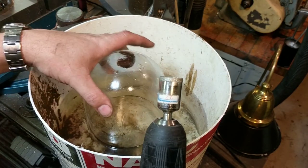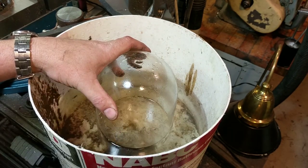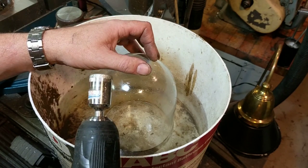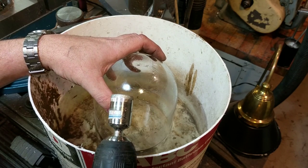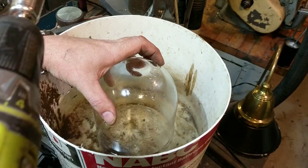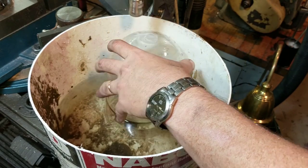I'm going to try drilling through here using this diamond-tipped core drill - they're dirt cheap on eBay. The trick with drilling especially thin glass like this: number one, you have to understand this may not work, it may shatter because the glass may be under stress from its manufacturing process. Number two, the trick is plenty of lubrication and lots of patience - very little pressure, just barely letting the weight of the drill rest on the glass.